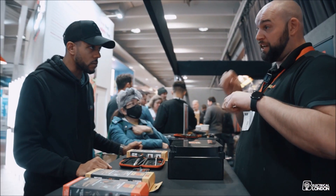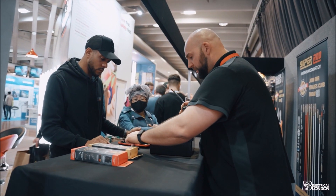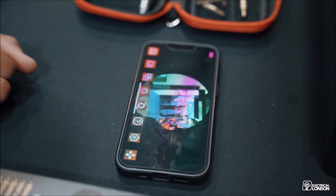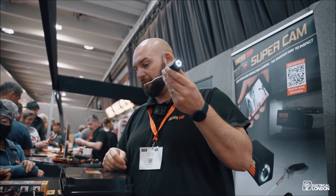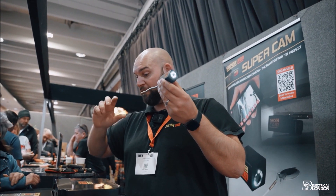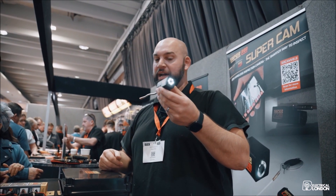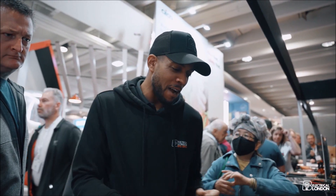You can turn the voltage detector on and off and it gives you a red ring around the screen and an audible tone. But the best feature is the standard viewing mode — if you're 20 meters away and want to know which way is up or down, it's got an always-up feature. The gyroscope kicks in and it'll always show you the same way up even when you turn it around. Even though the camera's upside down it's still showing the same way up. If you've got to tell a customer you need to make a hole in the ceiling or floorboards and you get it wrong, this saves so much time.